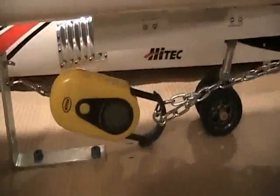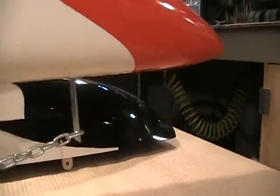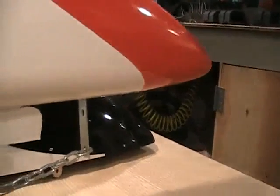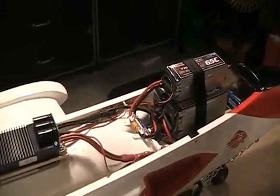The objective today is to measure the static thrust. In order to do that, I've attached a strain gauge — one end to the table, the other end to a bracket temporarily mounted at the bottom of the craft. I will also be attaching a shunt in order to pick off the current and display it on a meter.